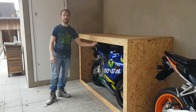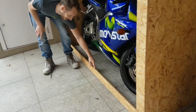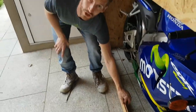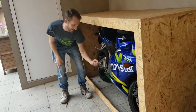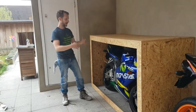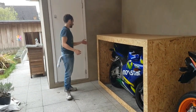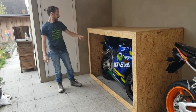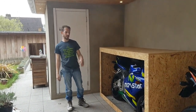So the only thing I really need to explain is this front panel. At the moment it's got no glass or perspex. I've put a little rebate on the inside — I've used 18mm construction OSB and I've done a 12 by 10 rebate for the glass to go in there. So once the glass is set in, it'll be nice and sealed. I can then just pull a plug — I've got a plug socket on that side — I can pull an extension lead through and have a dehumidifier in each of the boxes.